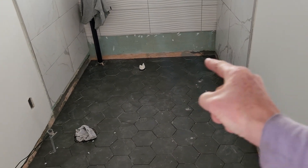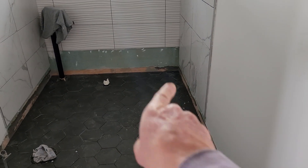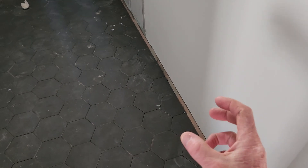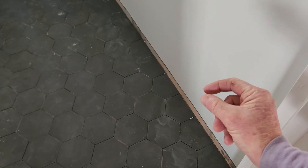There's going to be a baseboard here, so I haven't figured that out yet. If I use this color silicone bead around there, on the back wall you wouldn't even notice. But on these side lines when I lay in those final tiles — the area underneath the baseboards — if you're worried about grout crackage or movement, you can use a bead of silicone all the way down that edge and then put your baseboards in place for a little flexibility.